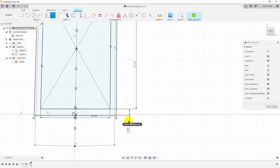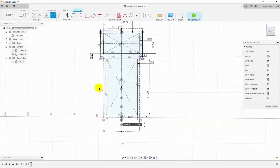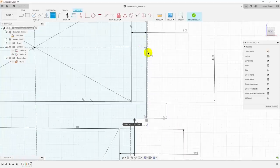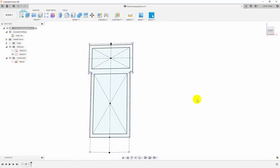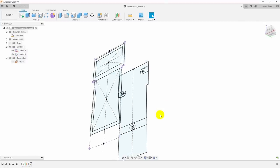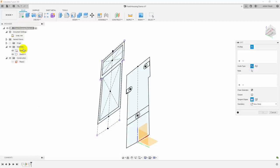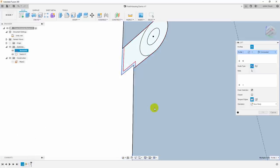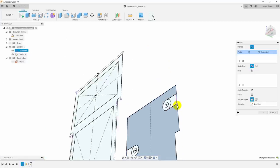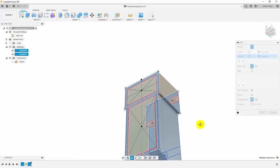You can see it doesn't perfectly line up with the base — in the switch portion it's slightly wider than the base against the casting, and up at the top it's actually slightly narrower, and it's overall shorter. Now we have our two sketches, and we just need to create a loft. I'll select the bottom profiles for the loft — only the outermost ones so the outer border is correct — then select the top profile and click OK. Now we have our loft shape.